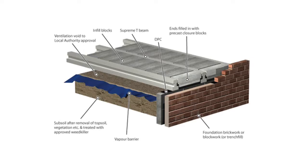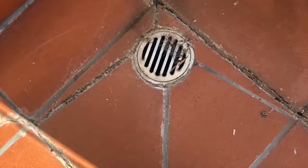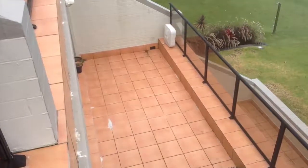If you can't get access to the underside to confirm, it will be evident with the amount of movement cracks, which is similar to that of a framed construction and should be treated as such. Concrete slab balconies go through a movement phase and then settle. These balconies are also subject to movement issues but they are smaller and easier to repair than framed construction.